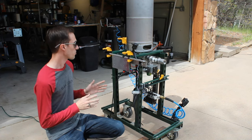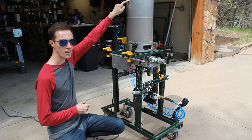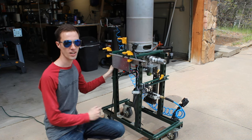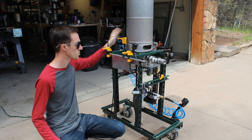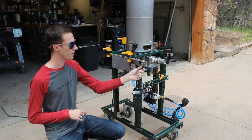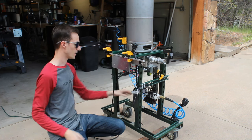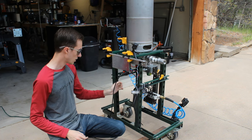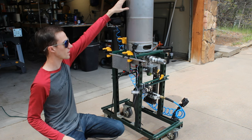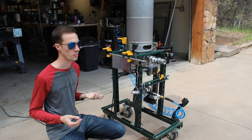I've got a little bit of a mess here of a setup. This is my main propellant tank for both fuel and oxidizer — it'll be symmetrical on both sides of the test stand. I've got a fixture here designed to help support everything; most everything is temporarily installed, which is why there are clamps all over the place instead of screws. I've got a power supply, a controller, and a valve bank connected through this mess of one-off wiring. I've got two valves wired up to my main propellant valve, and underneath I've got a high-pressure nitrogen bottle. I'm going to use this nitrogen bottle to pressurize the tank through a dip tube, which will allow me to vent the contents of the tank and test the actuation speed of the main propellant valve.